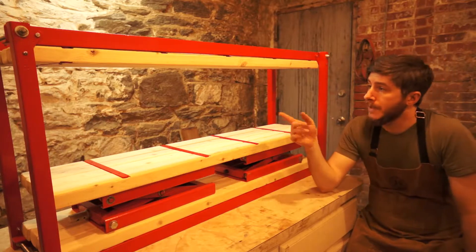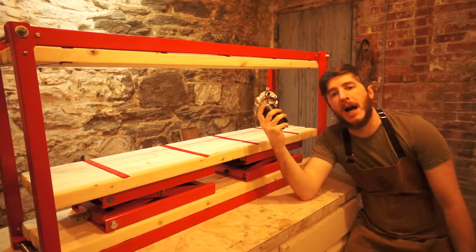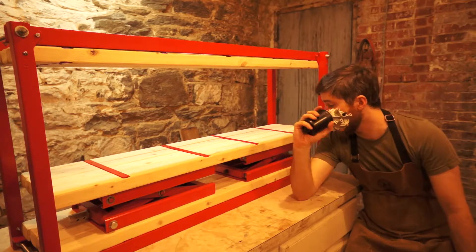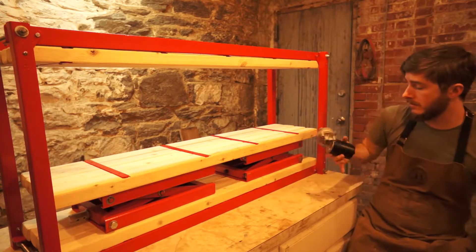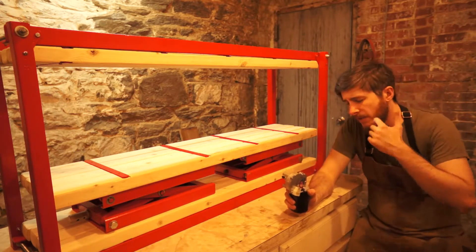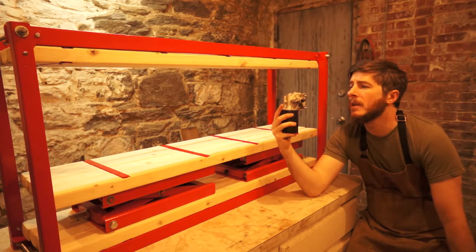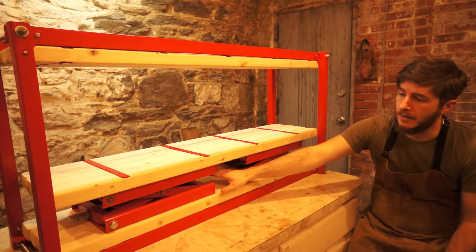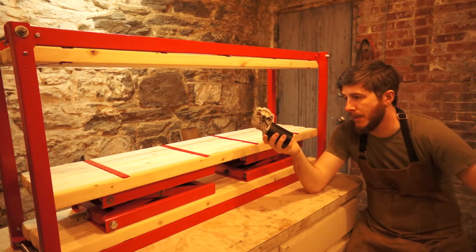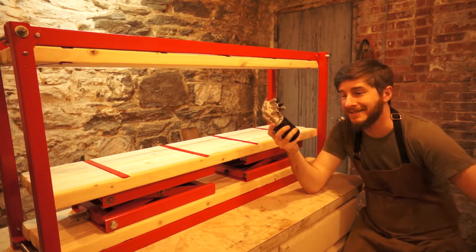So if the molds go in here the jacks will crank up and we could actually manually turn the cranks and press a board right now, but I have no interest in that because the next step is adding power. I've got two of these windshield wiper motors — they're supposed to have around 160 pounds of torque, which I think is going to work. I still have to figure out what the linkage is going to be between the drive shaft on these and the cranks on the jacks, because it's got a kind of atypical drive shaft. I'm waiting until the engine mounting and linkage are sorted out to tighten everything down on the bottom half. That's going to be the next video — we're going to address the linkage and the power system. I've got a bunch of electronic work to do and try not to electrocute myself. That's the last step and then the press will be done. Very exciting — I'll see you then.